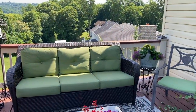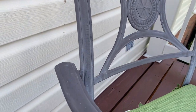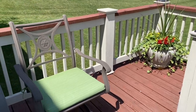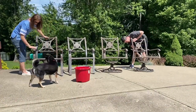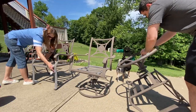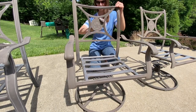This next simple project is going to renew and refresh your weathered old furniture very simply by adding a new fresh coat of paint. I think it is super important to buy quality pieces. These are worn and have seen their better days, but can you believe these are over 15 years old? With a fresh coat of paint they are going to look brand new. Before we start to spray paint, you need to prepare your surface — give all the pieces a good cleaning with some all-purpose cleaner and a rag, making sure to get all the dust off. If there's any chipping or rust, go ahead and sand that off lightly before you start spray painting.